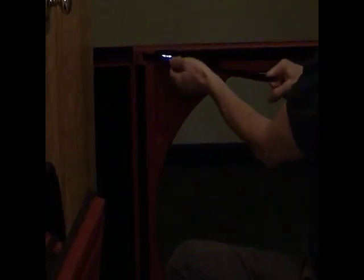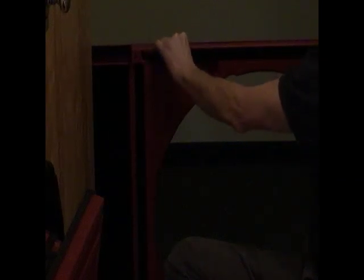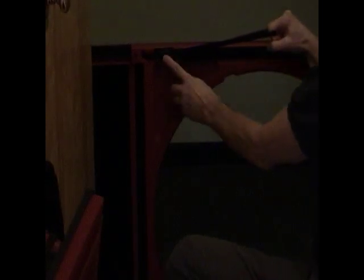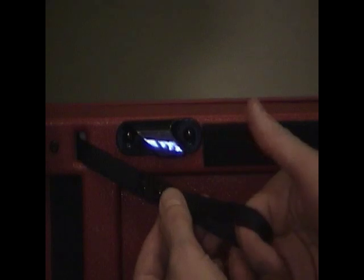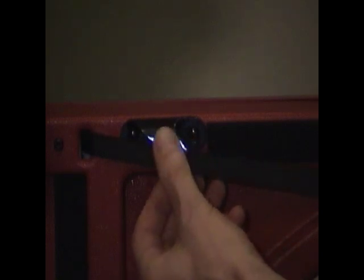And all of the force that we're pulling that with is contained or held by this little cleat. We just bring the strap underneath that, and perhaps you can get a close-up view of that. I've got the strap around my finger here, and I'm going to pull back along the line of the doorway or of the door panel. So I've got lots of tension in it. I'm pulling with about 10-15 pounds. I slide it underneath the cleat.